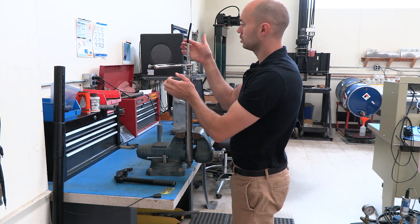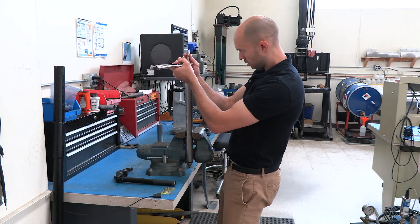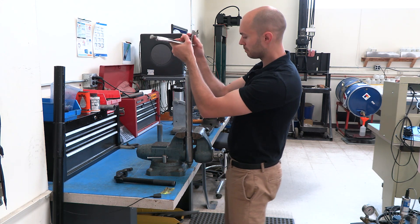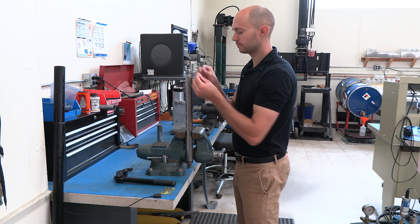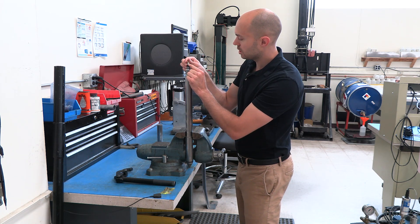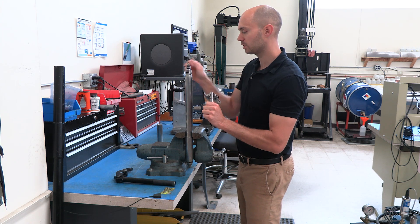Once I have this good and loose, I can go ahead and unplug my cable. Just visually look inside and make sure nothing looks damaged. Slide this up, and you'll see there are these two little split rings right here. These are what actually pinch this little stainless steel collar against this housing right here, and that's what prevents this from spinning when it's all assembled.